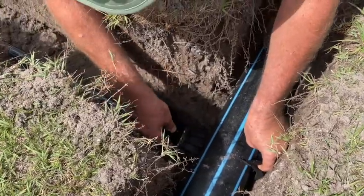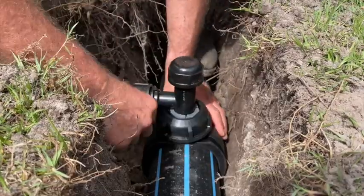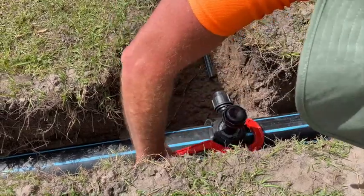along the pipe. The main retaining nut is firmly tightened using either the wrench used on Plasson 40-75mm compression fittings or one with a 300mm long handle.